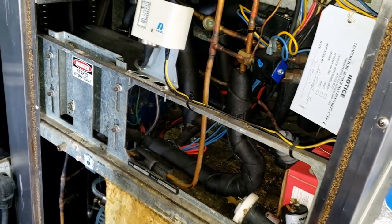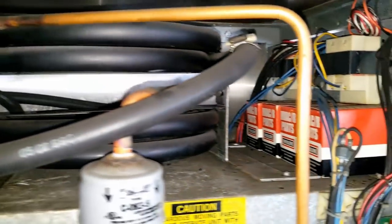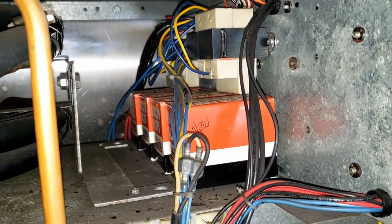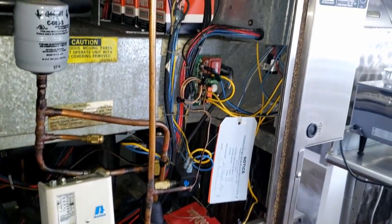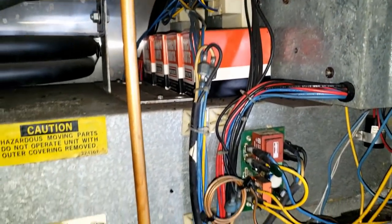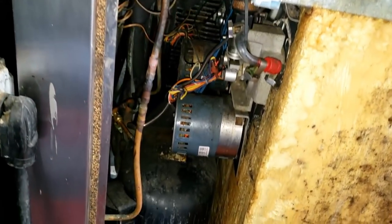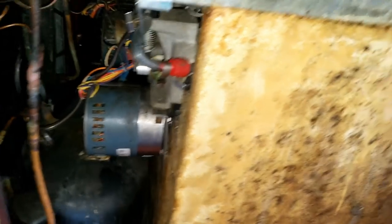These are water-cooled pump-and-dump machines. I sold them some extra contactors for later, and that's what I used today — believe it or not they worked out great, since these are 24-volt where the other ones are usually 230-volt. Checked the mix pumps in the back to make sure those aren't all worn out.